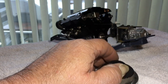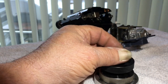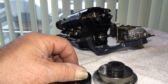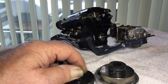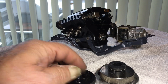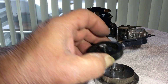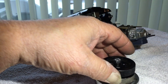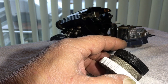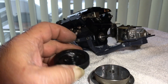Now on the flywheel you're going to see there's a recess side and then there's another recess side with a boss on it. You take your two flywheels, lay it down with the boss side up, screw this in through the first flywheel. I'm trying to hold a light with one hand — I'm not in my studio and my lighting sucks up here, so bear with me. You want to get a nice long 6 millimeter bolt. I bolted this on there and tightened it up flat to flat. Now the funny thing is these flywheels are almost exactly the same circumference — they are the same circumference, just recessed inside for lighter weight.